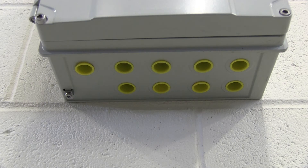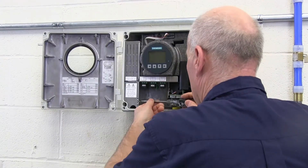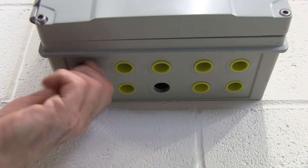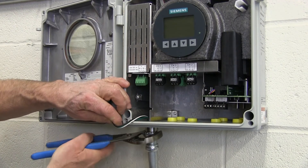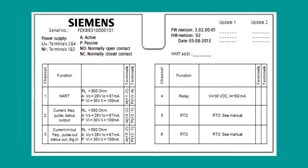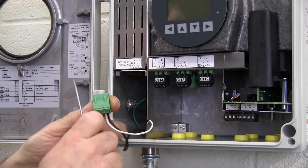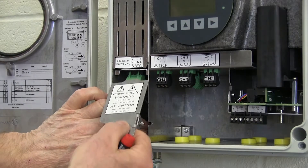Select the case openings you will use for power and signal cable connections and remove the blind plug from each. To begin wiring the transmitter, open the meter door and remove the power input cover. Thread an NPT adapter into the case opening, feed in the power cable, then seal the conduit connection. The FS-230 accepts either AC or DC power. Note the termination points on the cover label — the terminal connector is removable for easy wiring. With the power wires terminated, reinstall the safety cover.